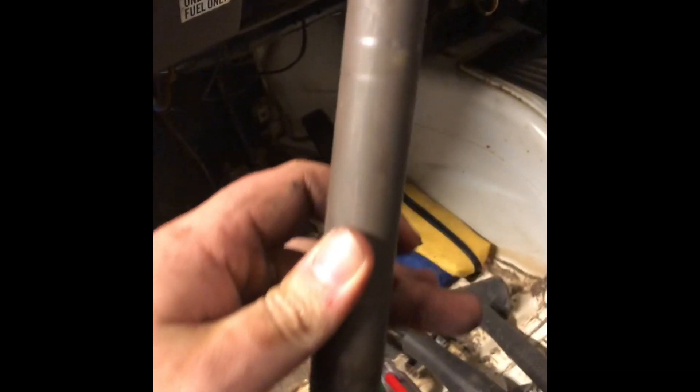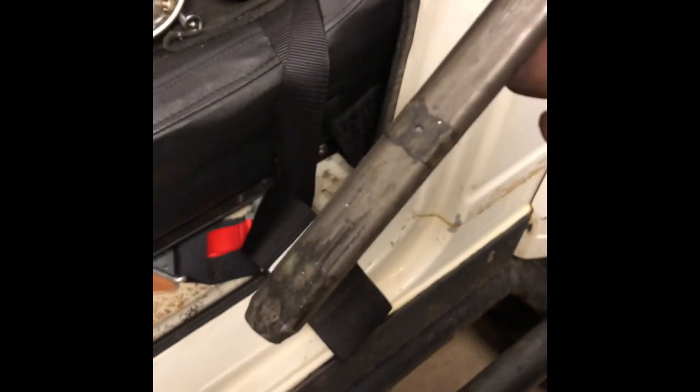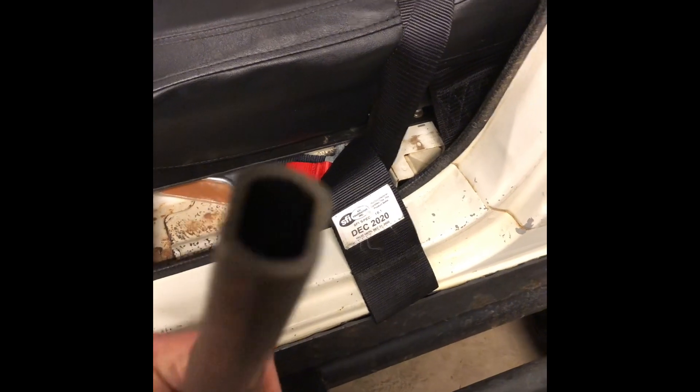Alright everyone, so it looks like I've got it figured out for the back part here. I put the old bottom half of the steering shaft into the joint here and just let it hang underneath the dash. I went ahead and put the motor back in, lined everything up, and it fits right about here. I got to thinking that's gonna be a pain to get in because it's all gonna have to line up just right — and it's perfect. This comes all the way out, and this is what slides inside the ends of this shaft.